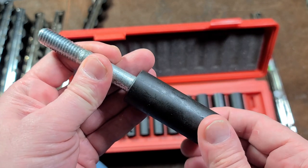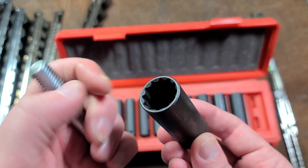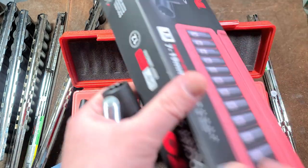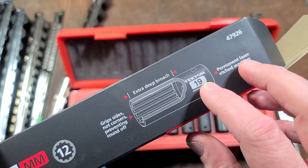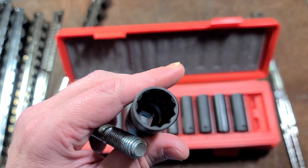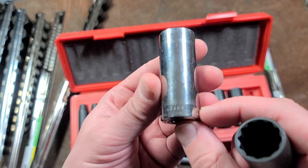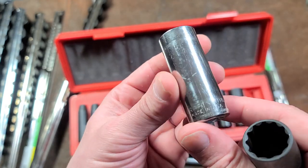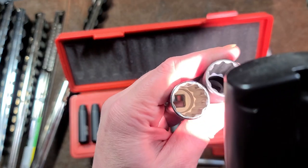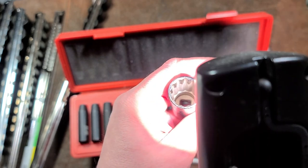This is a 19-millimeter on a three-quarter inch bolt and it is pretty tight. As far as the broaching, I would say it's about halfway down. They do call it a deep broach — on the box it says extra deep broach — but really it's not that super deep. Let me get a flashlight. We just saw in the box they are deep broach. What I have is some Craftsman G1 series — some of the last of the American-made ones. The Tekton's advertised deep broach, and we can clearly see that the Craftsman's is much deeper.